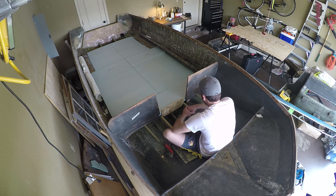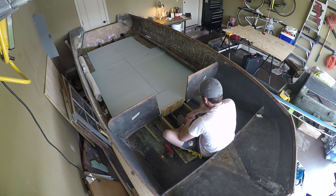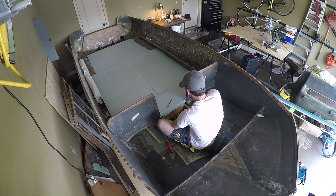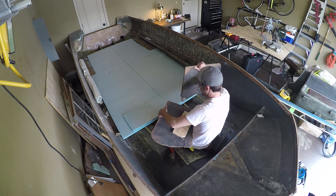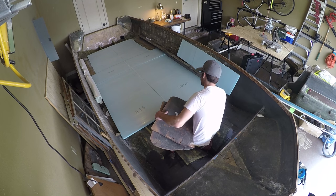This tells me a lot about how the deck is laid out. What I want to show you here is that with the foam sitting in the boat, at the very front there is another bulkhead that I had to create. That bulkhead sits on top of that center dagger stringer that I built and it goes up to the top of the deck, so it's got to meet that perfectly flush. The reason I'm doing this foam and trying to get a measurement for that is because this is where the bow rider section sits on top of — it sits on top of the deck and on top of this wood that meets the deck flush. Once I put the fiberglass and tab it up to these cap supports, it's also going to wrap over and be fiberglass to this center cap support bulkhead.